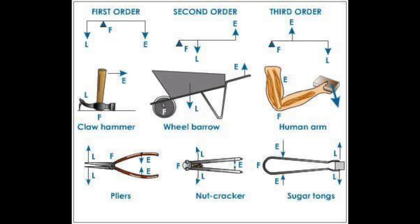There are second order levers, and that's where the load and the effort are both on the same side, but we're still getting a mechanical advantage. In the example of the wheelbarrow — I always like to think of wheelbarrows carrying a whole bunch of number twos, right? If you're using manure to fertilize a lawn — manure, number two, second order lever. The load is close to the fulcrum, and the effort is further away. A nutcracker is the same thing.